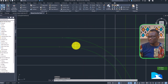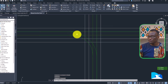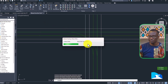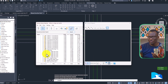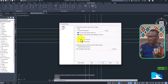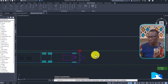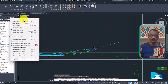This is all in real time — I can edit this. I'm trying to estimate the swept path. Last time we did this manually. The beauty of this is when you open vehicle tracking and say the vehicle is WB 19, which is a very popular design vehicle — I go to vehicle category and check the length. I draw automatic drive, click OK, reset on the left-hand side, and simulate to check we're okay. I'm assuming 15 kilometers per hour since we'll have traffic signals, but you can adjust based on your case.